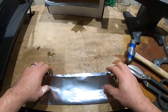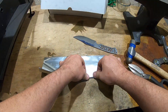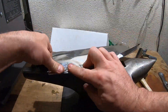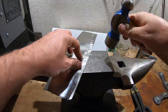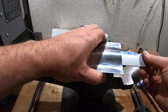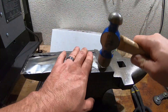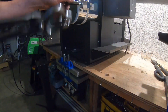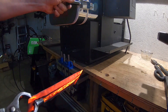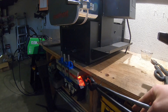For stainless steel you must have a zero-oxygen environment, and that's why we have these stainless steel wrappings — little pockets that we put the knife in. I'll normalize it in this pocket and also heat treat it. The heat treat for this stainless is at about 1950 degrees Fahrenheit, and then you put it between aluminum plates and blow some air on it, and that heat treats the knife.